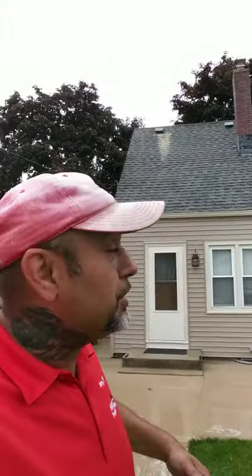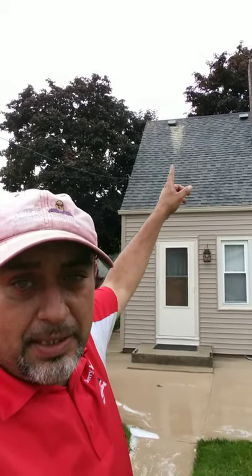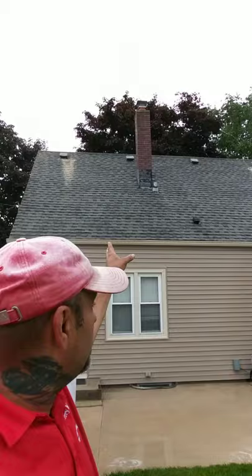There we go — right after the second coat, as you guys can see, no more black mold staining. We did not rinse, as per the recommendations of ARMA, the Asphalt Roofing Manufacturers Association. The lichen underneath the vent here has turned bright white, so it'll become brittle within a day or so depending on the weather, and after a rainfall or two that will all be gone. After a few rainfalls the actual roof will brighten up itself since we didn't rinse — we just got rid of all the algae and mold staining.